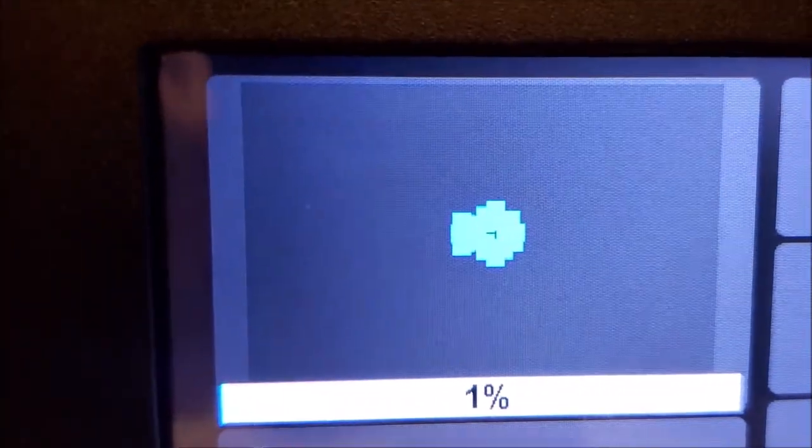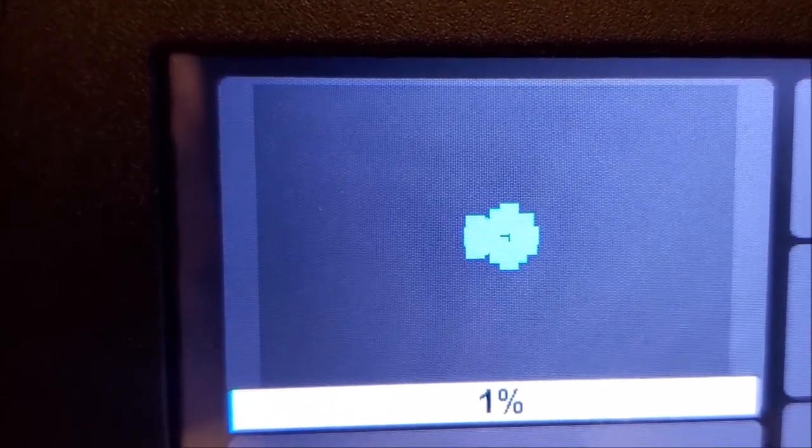So what happens is this build plate gets close to something called a FEP material at the bottom. It's completely transparent, and underneath that is a high resolution LCD display, black and white. So what it does is, go down here, see that little image? That's the first layer. That's the support layer. That's why it looks really funky, because each of the support posts has a square bottom to it. So it's now exposing that.